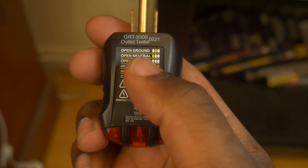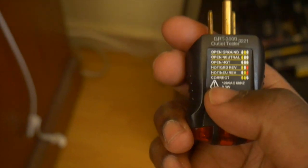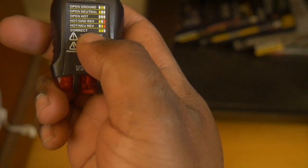Let's go ahead and do this. Let's unplug this first. What this outlet tester does is give you a code right here - it lights up when you put it in the plug and tells you what each code means. What we want is two yellow lights to the left. The bottom one works, that's good. The top one - nothing. So we have a bad outlet.